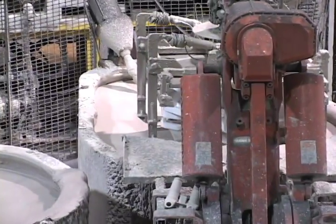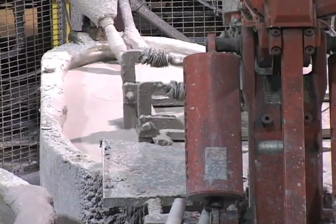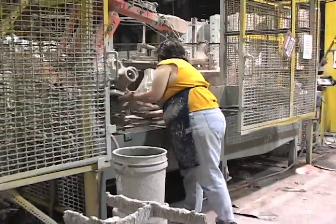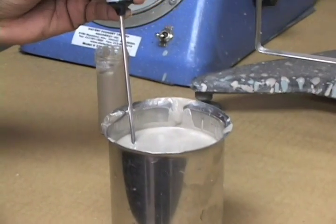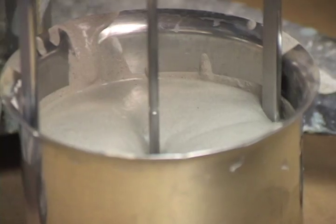These clusters are then robotically dipped in a refractory coating, carefully formulated to make the casting process work. The coating is a key factor in the entire process, and is very carefully controlled through testing for viscosity and permeability, because it has to control the velocity of the foam's gas dissipation.